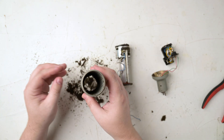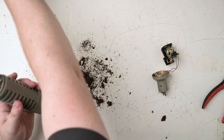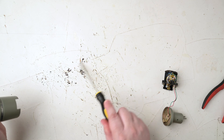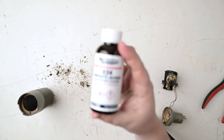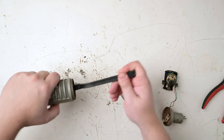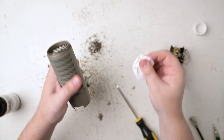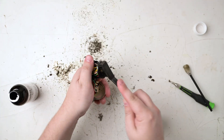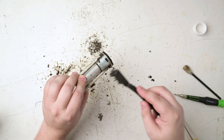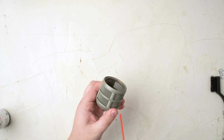We are in. And it looks rough — everything is just absolutely covered with disintegrated foam. It's hard to even vacuum up because it's so sticky. You can see when I brush it with a screwdriver it just smears. I had this small bottle of 99.9% isopropyl alcohol I had gotten for working on PCBs so I'm going to use that here. I tested the gray finish on the inside of the mic and it doesn't look like the color is affected by the alcohol. So from here I just went to town with the alcohol, a plastic brush, foam swabs, and lint-free cloth. I also used a little compressed air but kept that away from the mic capsule.